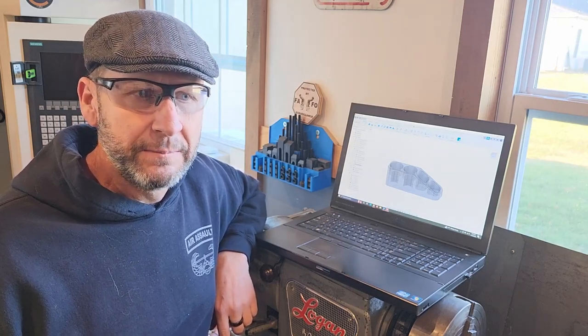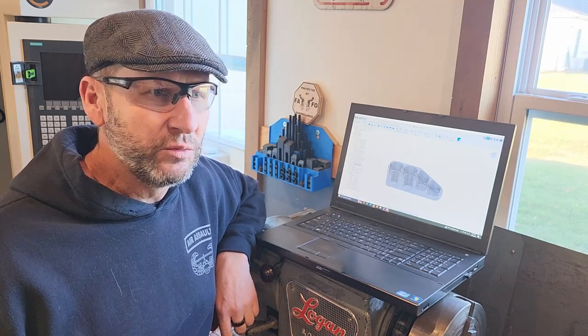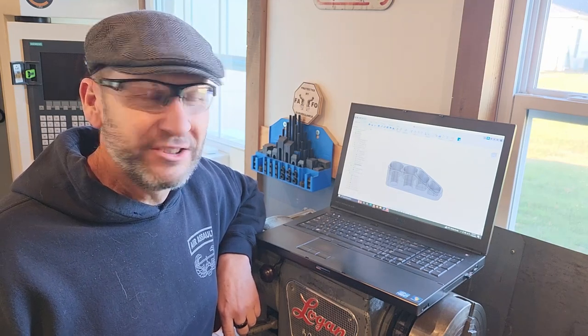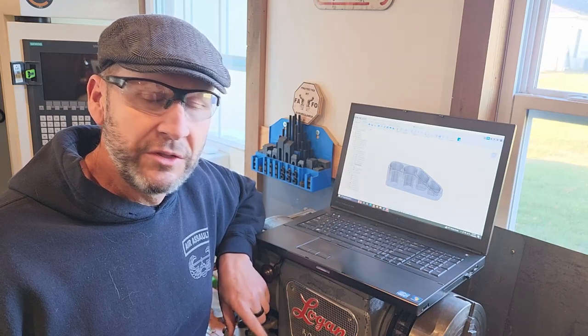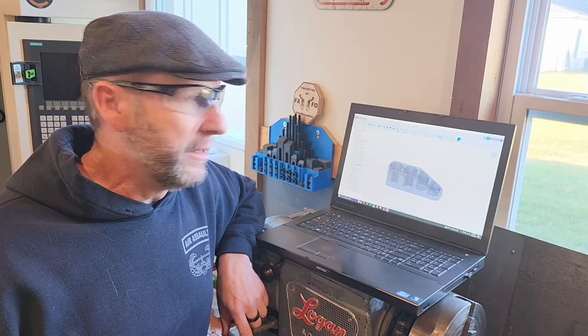So that'll be interesting. You'll notice in a lot of my videos, I'm trying to get away with a 12.7 or half inch 4-flute end mill, and it just seems to be too much for this machine. If I really slow it down and don't let it eat too much, it's fine. Otherwise, every time that ball screw changes in the Y, it screams, it chatters, the Syil doesn't like that half inch end mill. So I'm switching down to a 3/8 end mill, and I'm running it in mild steel.